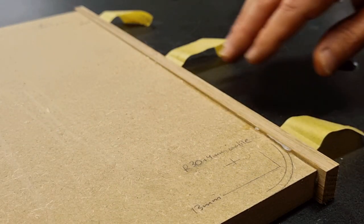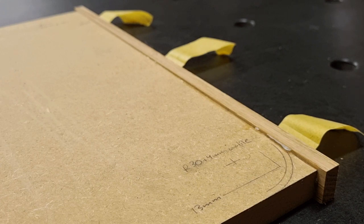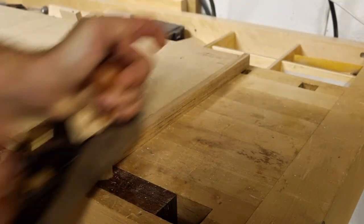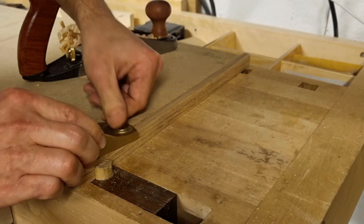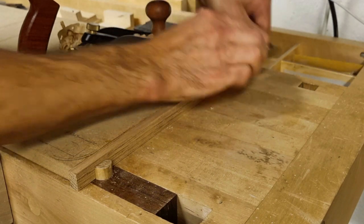When the glue has dried, the next step is to trim the edge banding flush with the base material on both sides. I have three different methods. If I'm only making a few pieces and the grain is nice, I trim with a hand plane — starting with a larger plane at a coarser setting, then switching to a small block plane with a finer setting. This hand plane method is actually really quick for one or two parts with cooperative grain. But if I have more to make or troublesome grain, I switch to the router table.